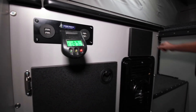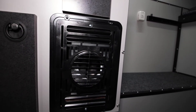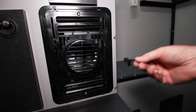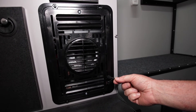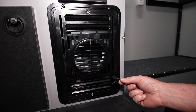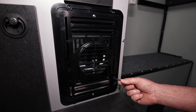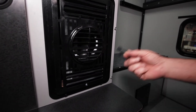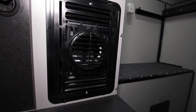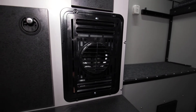The propane tanks are open and we know we have propane. I'm going to go ahead and try to fire it up again with the fan running and let you listen for the clicking. After attempting: you probably couldn't hear it, but what I heard was the propane valve opened — just a small clunking noise — but no spark and no ignition. The fan is not running fast enough, so we're going to put a 12-volt battery charger on the outside of the camper.